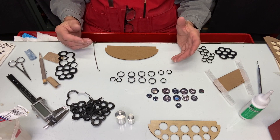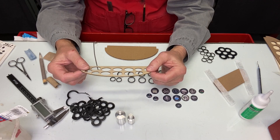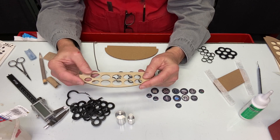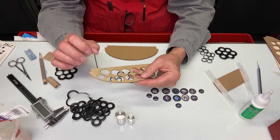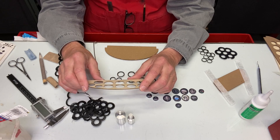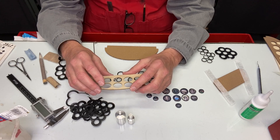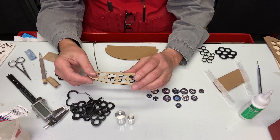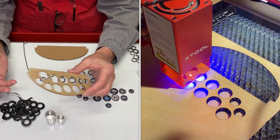We also need the face of the instrument panel. This happens to be 1/32nd birch plywood, or 0.8 millimeters — very thin. I like using this as a surface because I want that metal look. The grain is very smooth and fine, so it's easy to finish. You can use balsa wood, but it requires a lot more preparation in terms of finishing to achieve that metal look.